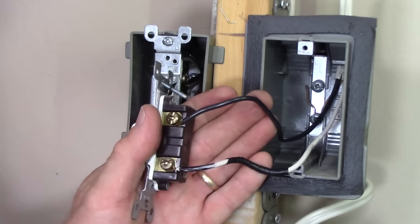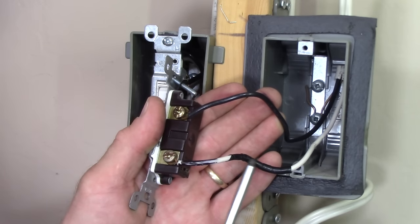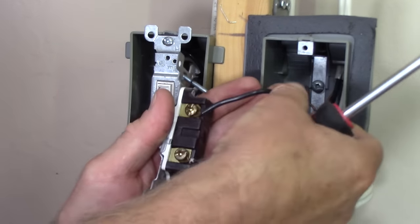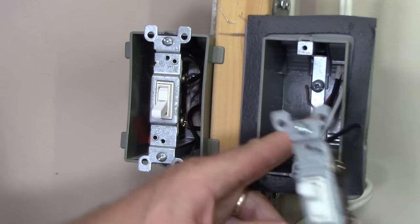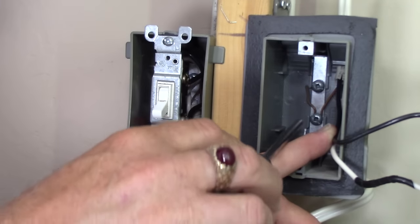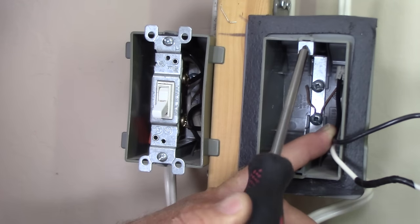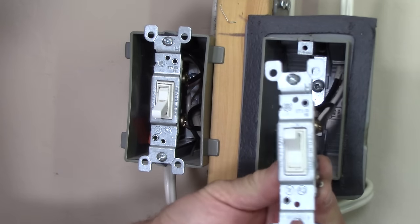Let's go look at the switch. Moving on to the switch location — you remember that white wire in the light outlet box that we identified as hot. That can be done in a couple of different ways: colouring it in with some black felt pen or with some black electrical tape wrapped around it to identify it as hot. Power comes in on this switch to one terminal, and back out on the black wire to the light to control it. In any device box, you need to deal with your ground wires. Here it's a plastic box — there is no ground terminal on the switch, so we don't have to provide a pigtail to the switch terminal itself. But the ground wire from the two-wire cable is attached to that back strap, which is a metal strap inside the plastic box that is continuous out to the tab where the device screws mount, providing a ground for the frame of the switch through that grounding strap.